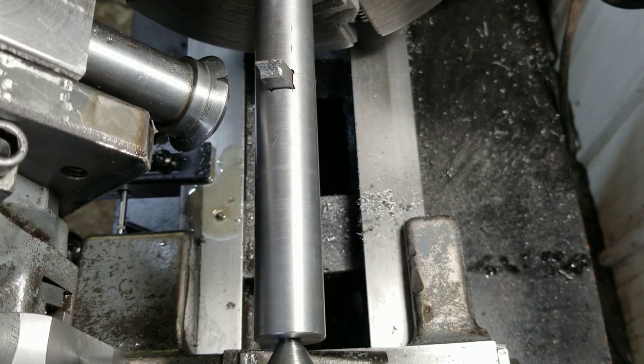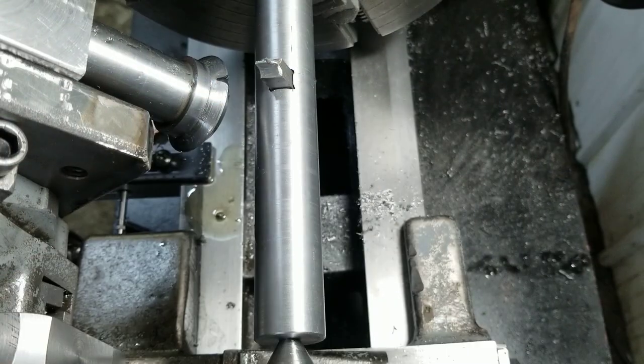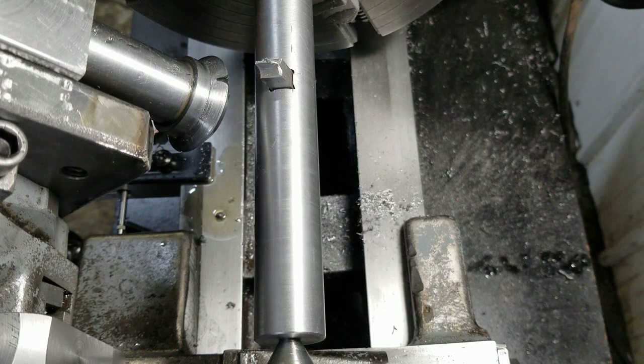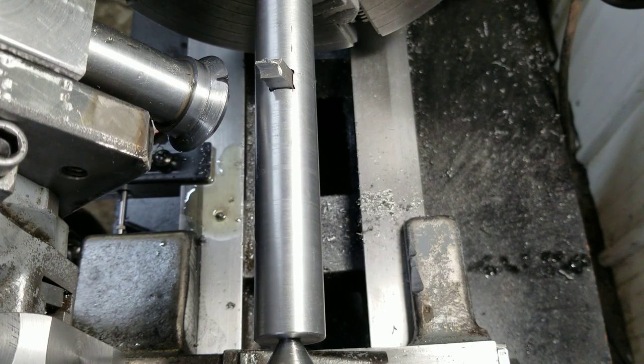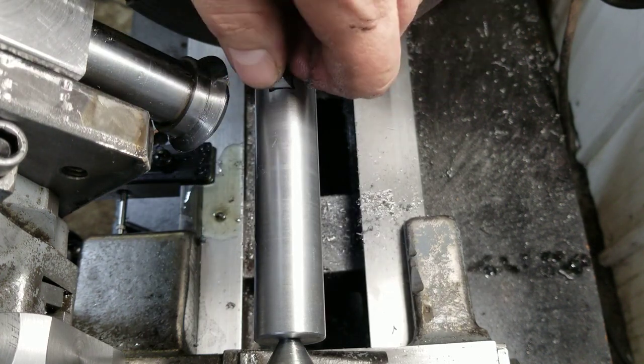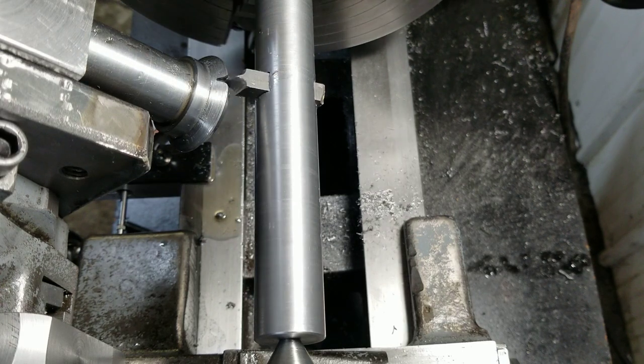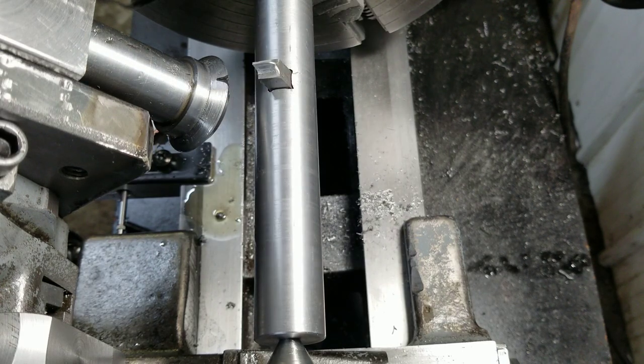This is going to be a bit wider by the time we're done here. I'm going to have to cock it back that way. Right? Or the other way, one way or the other. And we're going to have to offset it at some point. I don't really want to take the cutter out. That seems to be doing the job. I can't really tell what it looks like in there. Well, we'll keep going. Worst case scenario, I got to make a new gear blank, I guess.